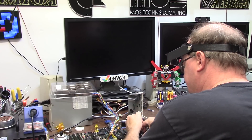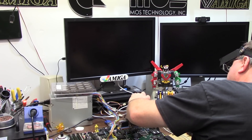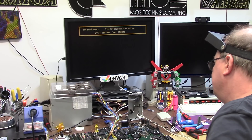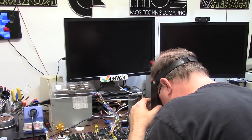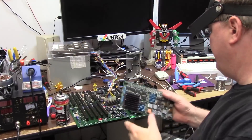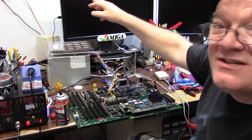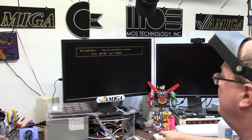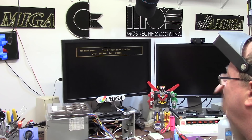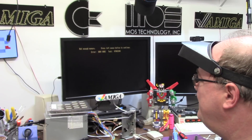What's next, Ramsey? Let's do you too — why not? Decent snap. Oh, what the hell, we'll do Gary too, because that's never been out. Solid snap — board's getting greasy. Everything was working perfect and now it's not. I'm gonna replace the sockets for Buster and Ramsey. Mr. T edition for my 4000 — we're gonna slap that in here too. That takes the CPU out of the equation and the FPU because it's on board. Note it blinks faster now — look at that, super fast blink. That's not the CPU. Let me take this out and jump right back.